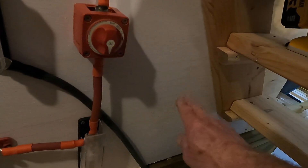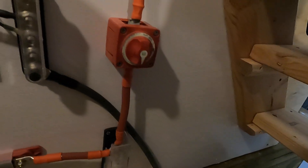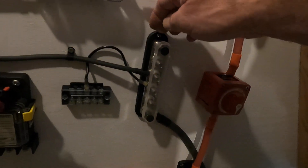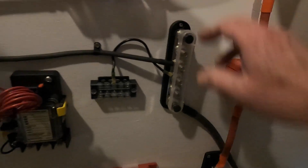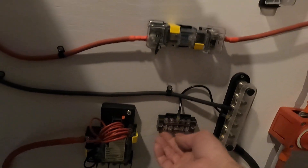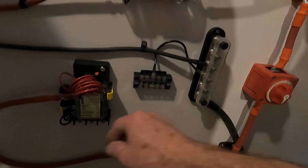On the negative side of things, you're going to have to imagine there being a shunt in there so we can keep track of our power in and out. The shunt will go there, come into this bus bar here, and then it goes out to wherever we need it. This one is 6 gauge which goes up to the panel. This is just a little bus bar for miscellaneous odds and ends — the pumps or wherever I decide to run the ground.